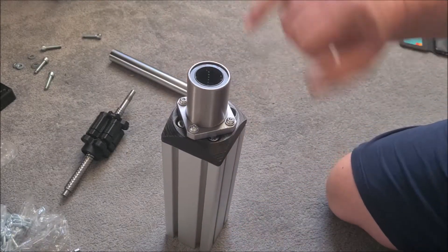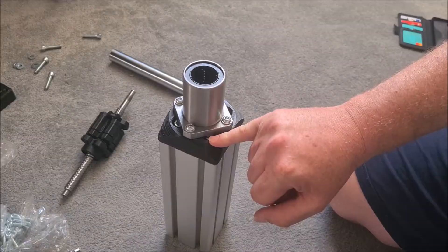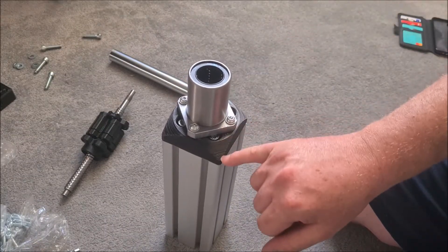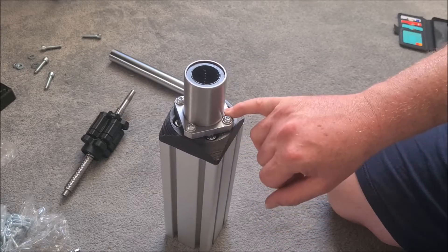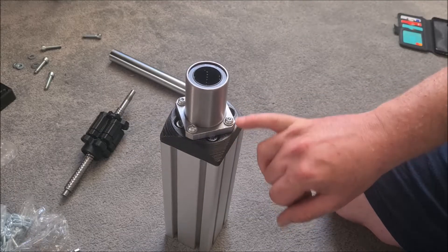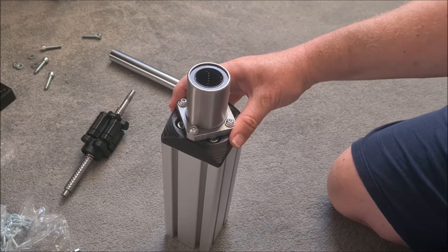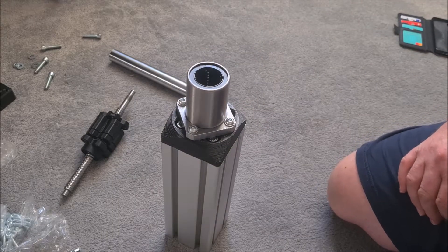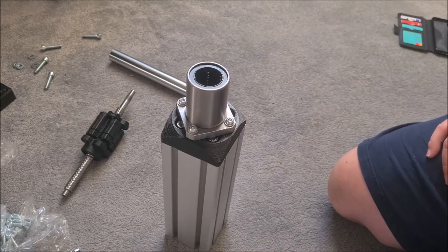I tapped them M6, then used M6 button heads 35mm long with washers bolting the bearing into the end cap. I've got a plan in future to get these end caps laser cut in two pieces so that we've got the opportunity to thread into metal rather than plastic. The way this is all designed, everything is in compression anyway so there's no load on the threads, but I think it will be quicker, easier, and potentially cheaper to have them laser cut, and obviously the threads will then be stronger.